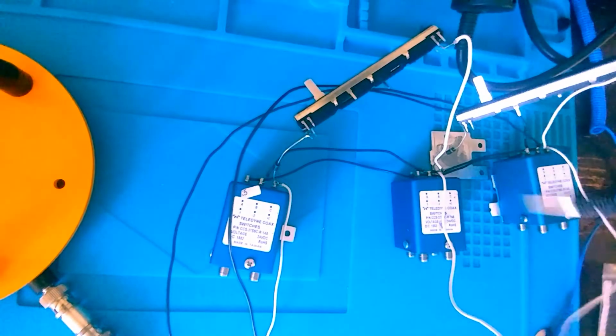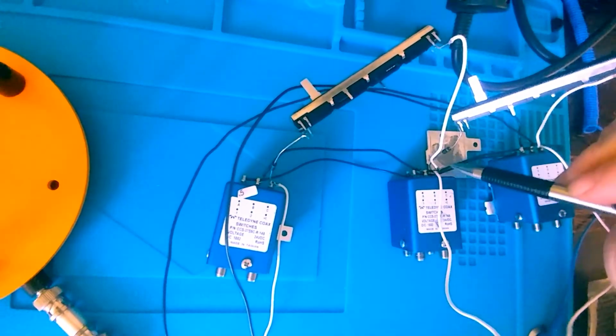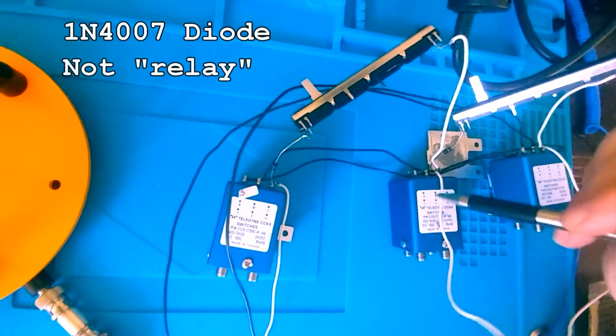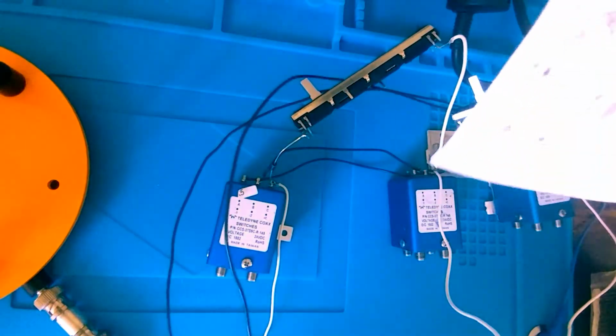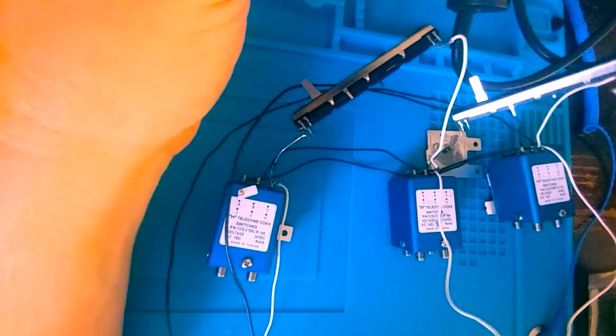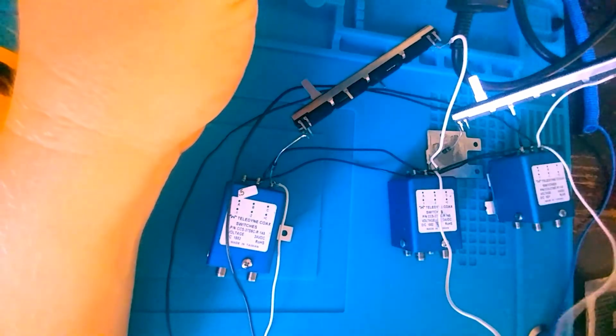I believe we had to overcome a flyback voltage, and you could do that by putting these 1N4007 diodes across the coil itself. But you can also use them with what we previously tested. Like I mentioned, I didn't like the fact that when I applied 24 volts DC to the common here, it also created a condition in which K5 and K3 would also energize